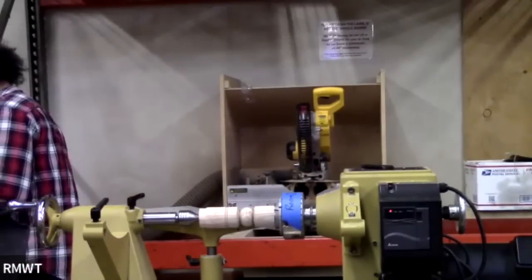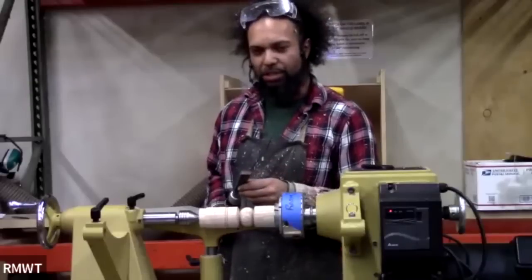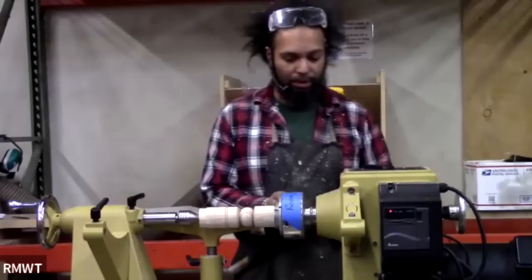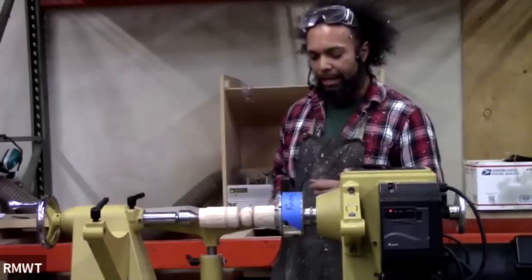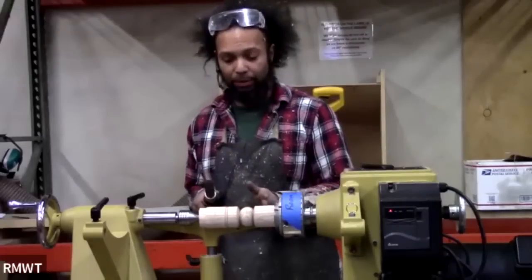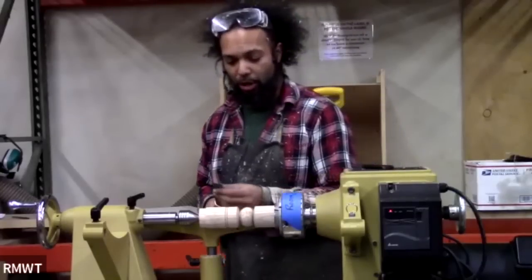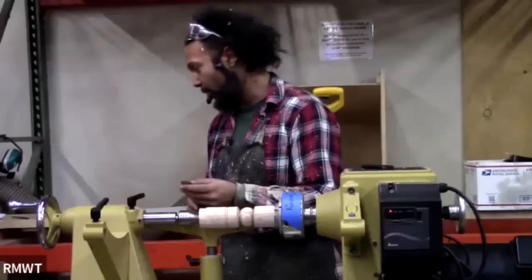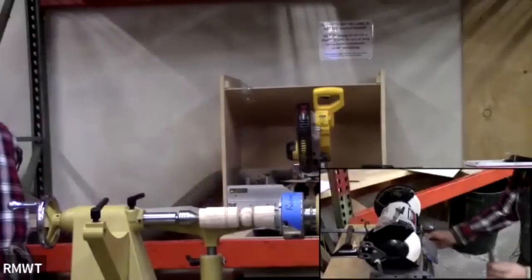Okay. Also, let's talk a little bit about the burr. I like to keep the burr on the tool. The tendency that I have is when I'm making peeling cuts, I'm typically working from the tailstock side to the headstock side. I'm usually going from the right to the left. Knowing that's my tendency, I prefer having the burr on the top side of the tool. My top side, as I see it, would be the long point facing the chuck, this side right here. So what I'll do is sharpen the underside, put the burr on the top here, then I'll turn it around. And the second pass that I'll take on the grinder will be on the underside with the long point facing this direction here. So I'll go ahead and do that real quick.